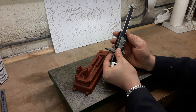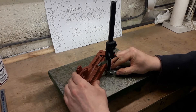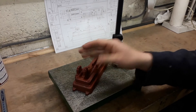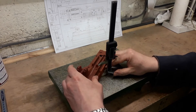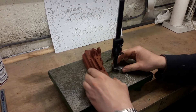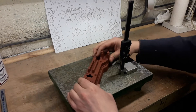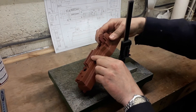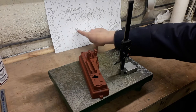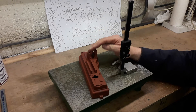There we go — that gets us close. This is just a rough guide. As I was saying in the first video, painting not only keeps the oil off your hands but it also works as a nice marking-out paint. You can just score into that and it gives us a marking line. You can do both sides, but it is just a guide. As you can see it nicely marks — it works like a marking paint. Then your next one is to the center, so it's 1 and 15/16ths to the center bush. We won't machine that at the moment but we'll mark that up in due course.